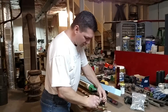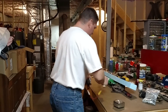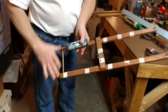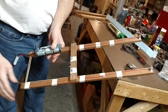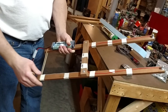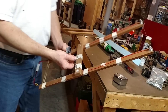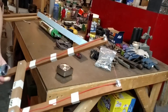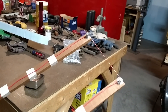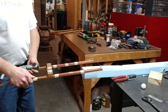So I decided to try hot wire cutting. A little bit of YouTube research, and I came up with a modified version of something I found online. This one's portable, and it operates by keeping tension on the back end as the wire heats up and expands slightly. It keeps it straight because the tension on the rubber band is in the back. When I turn it on, you'll see that it starts glowing red — it'll cut way before it glows red — and it's fine for doing cuts that you're not too worried about being super precise.